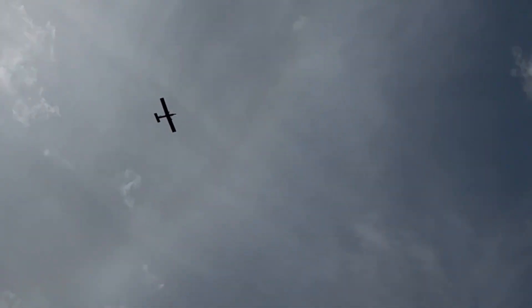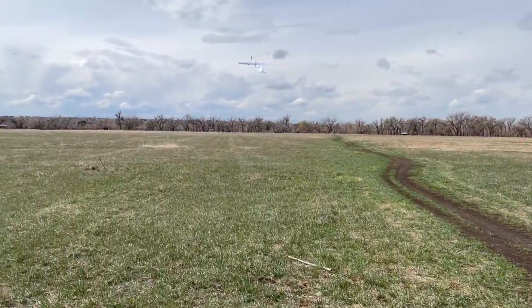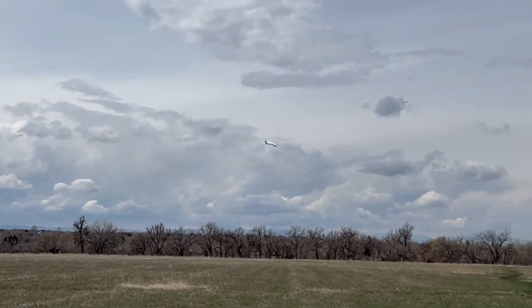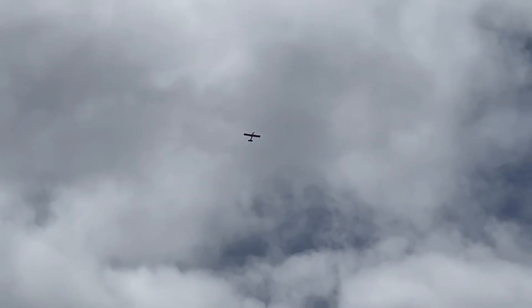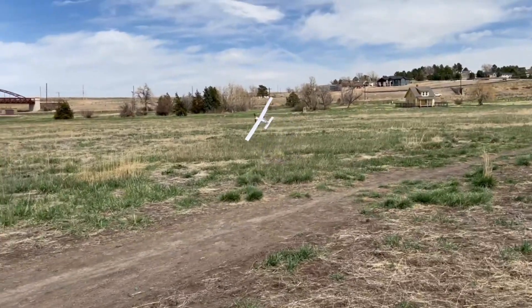The two major issues with this plane were: first, my landing gear was too short, which made the clearance from the bottom of the airframe to the ground relatively small — not great for testing different types of shuttle gliders. Second, the release mechanism was way in front of the center of gravity. It really should have been directly on the CG line, and since the shuttles were pretty heavy, it caused a huge upset while flying. So most of the time it would take off super nose heavy, then fly back tail heavy.